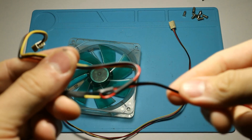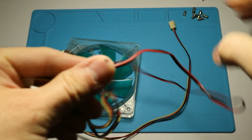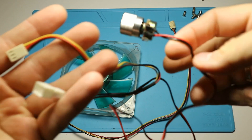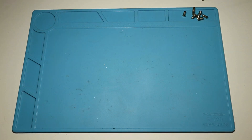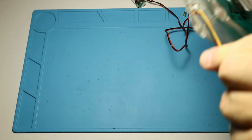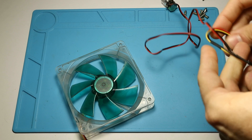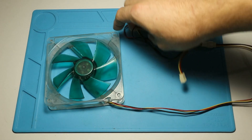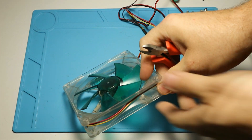It is fully optional, but you might want to use a mechanism to control the fan speed just in case. Luckily for me I had a fan controller laying around. A fan controller is basically a potentiometer with a fancy knob on it — in my case a 100 ohm potentiometer. By adjusting the potentiometer you're basically lowering or raising the resistance within the circuit, effectively tuning down or spinning up the motor of the fan. While I was lucky enough to have the controller at hand, I wasn't too happy about the lot of extra wires it involved because of the connectors and stuff. So I started cutting wires.